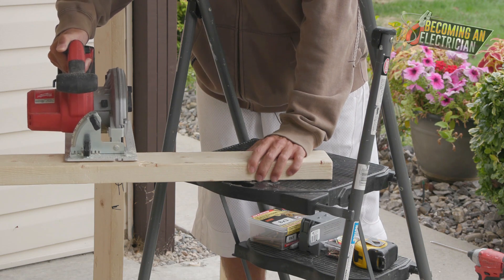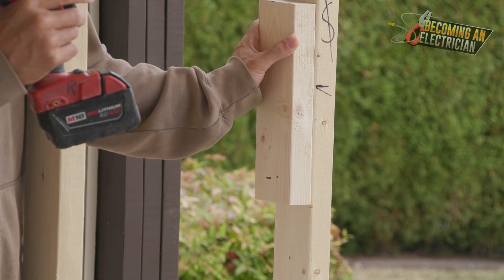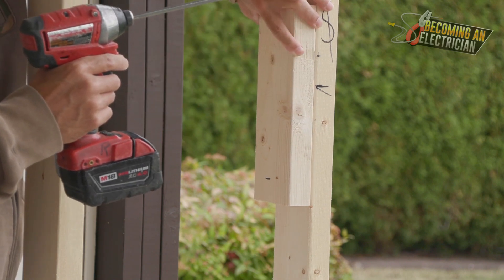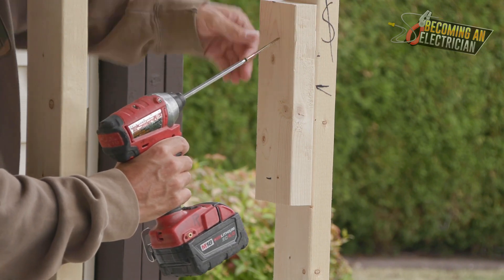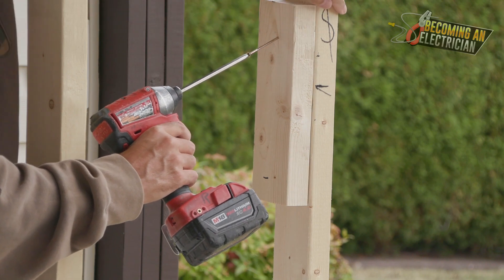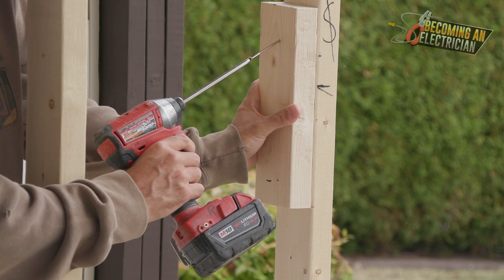What we're looking for is the top of the box, so we want to make sure our scab is just a little bit above that because of the ear of the box. You also want to make sure the scab is flush — you don't want it sticking out and you don't want it sitting behind. Another thing: the screw — sometimes it's nice to put it in at a little bit of an angle, it'll hold a little bit stronger. If you put it in straight it could potentially go out the other stud, especially with longer screws.